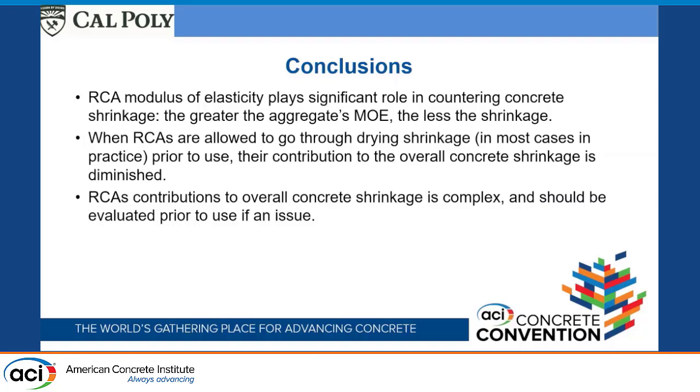And that's actually sort of where this research was going. Part of our thought was that there might be enough moisture that it might actually reduce the amount of drying shrinkage we end up seeing, because there's this additional moisture that keeps the concrete from shrinking. And that's, again, sort of where we're going. All I could say is that we're seeing this overall picture of this additional contribution.